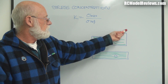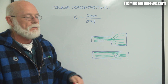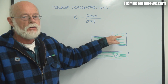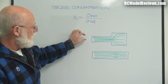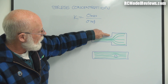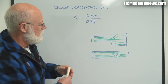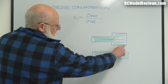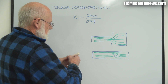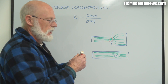I've drawn diagrams showing stress lines so you can see how stress concentration works. Here's a component — could be a multirotor arm — with a narrow bit and a wide bit, and the green lines represent stress concentration through the component. They tend to be relatively parallel, but when we come to an area where there's a change in dimension, they bottleneck — the stress lines don't take corners well, they overshoot — so in that area we have a build-up of stress called a stress riser.